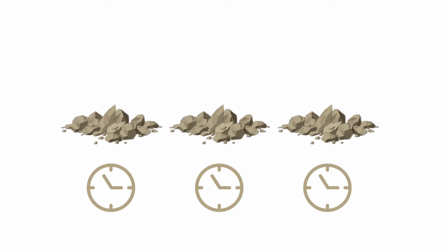Protect termination points as necessary using duct tape or similar, to prevent spillage of mixed resin and aggregate sticking to other surfaces. Ensure that all aggregates are fully coated in resin and all mixes are consistently mixed for an equal amount of time. Always ensure that a wet edge is maintained. Joints between mixes will be visible unless the older mix is still workable. The finished resin-bound surface can also be broadcast with our anti-slip material to achieve even greater anti-slip properties.